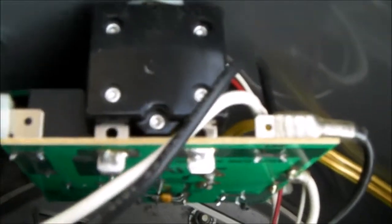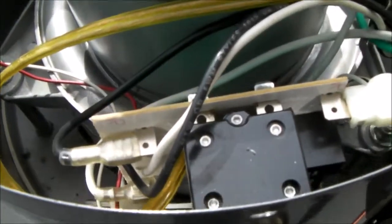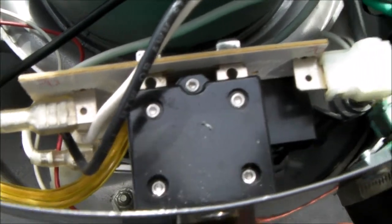The first thing you'll notice inside this unit is that there's a control board. This little standard control board is right here, and on that control board there's normally a transformer that's mounted on it. After a little bit of troubleshooting, I figured out that the real expensive part of the vacuum — which is the motor — worked, but for some reason the control board wasn't working.